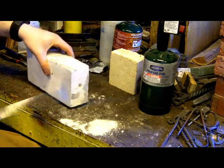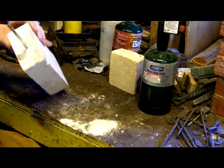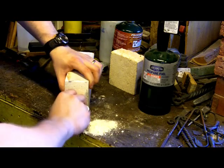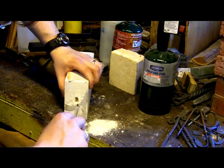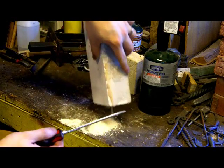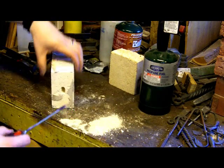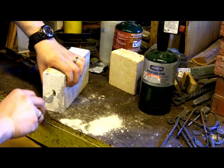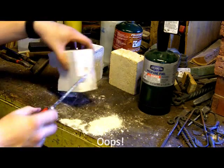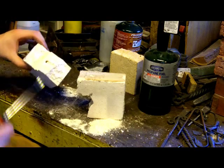You'll see that this is very small — you're not going to do a lot of work with a quarter inch opening. So we're going to chisel this out. This brick dust comes in handy for projects like lining a forge — you can mix it in with your ash if you're using ash in a Tim Lively style base and forge. You can see how soft the brick is, as the pushing action actually broke the brick right along here.